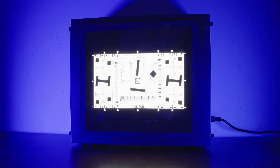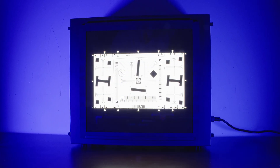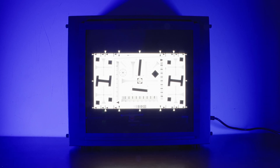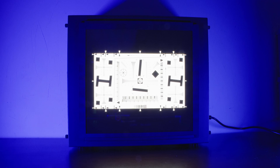To test the devices scientifically, we're going to use this ISO 12233 test chart. The test chart will be backlit by a light source capable of 0.01 lux all the way to 20,000 lux. This will let us measure the resolution of the units in both high light and low light conditions.